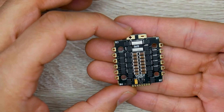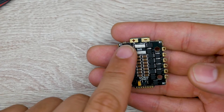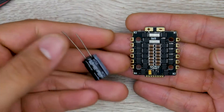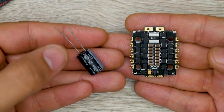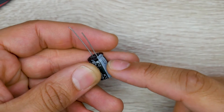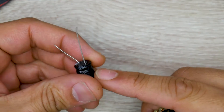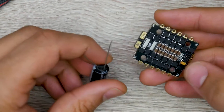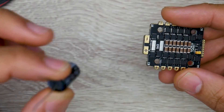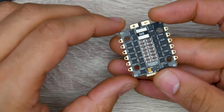They took their time designing it — you can see the plus and minus markings that tell you where the battery leads go. These holes are really great for adding a low ESR capacitor, which is a must. The minus side of the low ESR capacitor goes to the negative pin, and the side with nothing is always the positive. You can insert those through the hole and have a pleasant time soldering the capacitor pins along with the battery wires. There is also one shunt resistor.